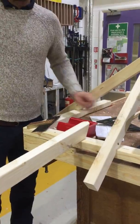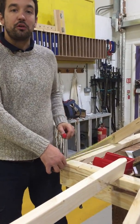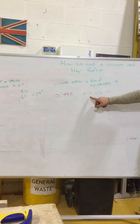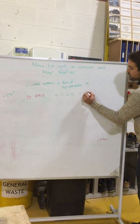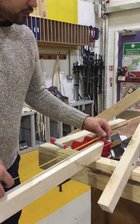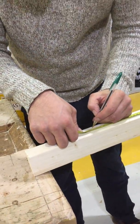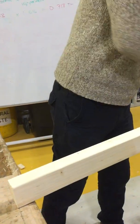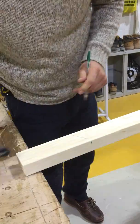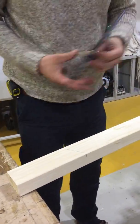What I need to do is take my clear span, which is the distance from this rafter to the edge of the wall plate — that's 443mm. I'm going to do 0.443 times 1.616, which gives me a true length of 0.718m. So off the top I'm coming down 718mm, marking the ridge cut, and cutting the back in at 45 degrees, the same as my common rafters.